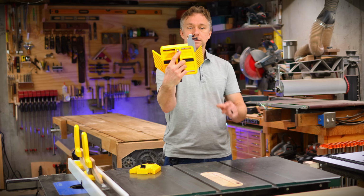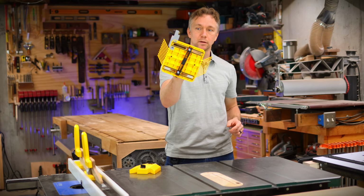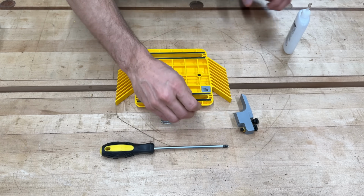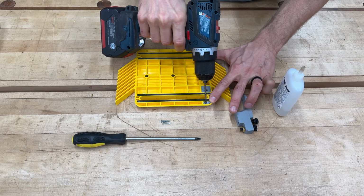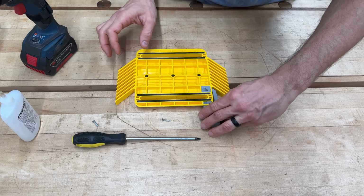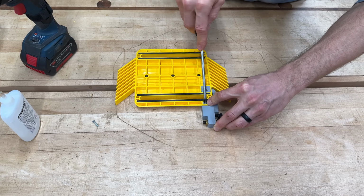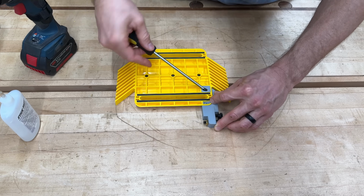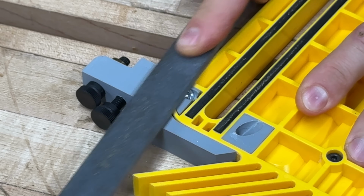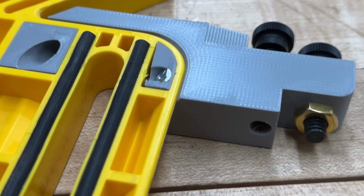You probably notice that I have another upgrade to this one attached in the same way. Let's take an actual look at that assembly. The 2 inserts that fit into the injection mold recesses are glued in, and then an 1/8 inch drill bit is used to drill a hole through the body using those inserts as guides. I put some glue on the add-on and attach it with 2 screws. Full disclosure, this was a really tight fit. Design was kind of tricky, and a couple licks with a file might be needed on that screw head to flush it with the bottom of the featherboard.